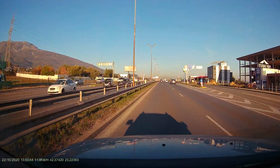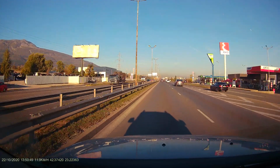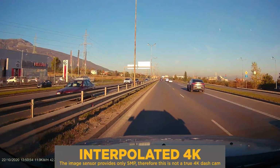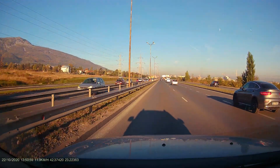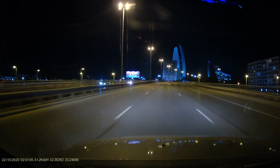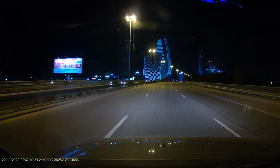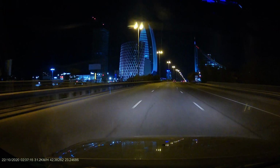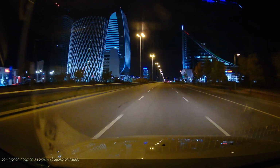If we assess the qualities of the dashcam by the last few features only, I was about to say that this is the best value pack that you can ever find, but advertised as 4K, it's supposed to have an image sensor with at least 8 megapixels capacity. So we're around 2 to 5 megapixels short on that, and I couldn't believe that Blueskysea have done it. Don't get me wrong, I've been stating multiple times in my reviews that having high-density, small sensors is a worse choice than using the same sensor surface for fewer megapixels, because this translates into better low-light performance. But it's not fair to use such sales tactics in 2020.